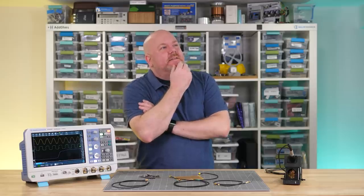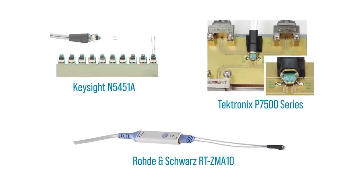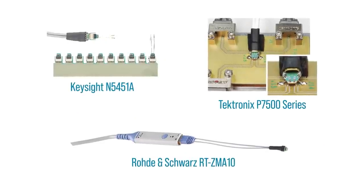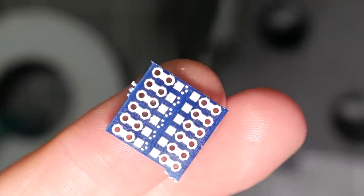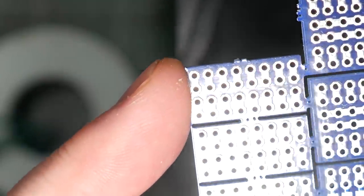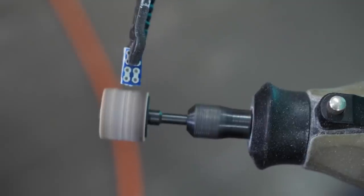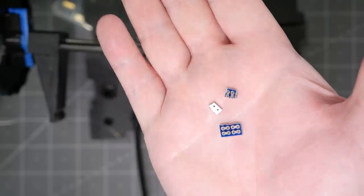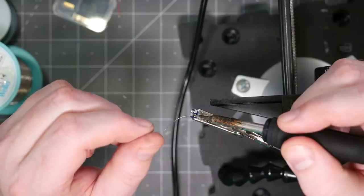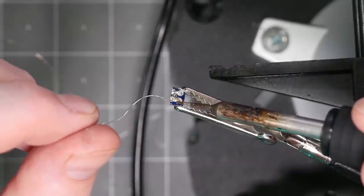So I got to thinking — that's when I thought of the high-end soldering probes that come with high-bandwidth scopes. They usually have a small PCB. That led me to thinking about the protoboards in my kit. So I grabbed my Dremel, because rotary tools are super cool, and made some really small adapters. My plan was to solder all of the pieces to these PCBs. Turns out, the 0805 resistors fit nicely between 0.1 inch pads.